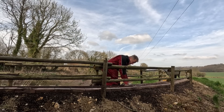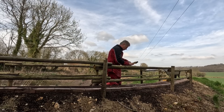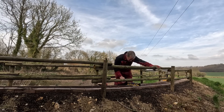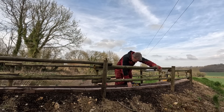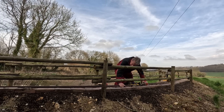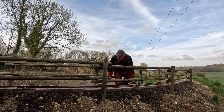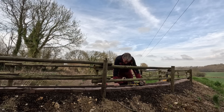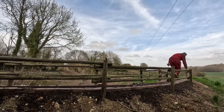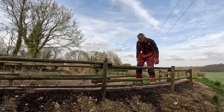I also need to set the track at the correct super elevation angle. I've got a little digital spirit level here. That's half a degree leaning out — that's completely wrong. The first thing to do is to lift it like so; the ballast will drop under the sleepers. Now it doesn't need lifting so much as tipping. That's now two degrees banked in — super elevation. I'm going to take the level off, get a look along the line and see what that looks like. That's looking really quite good now. It can go up a fraction more at this joint, because the joint will probably sink anyway.